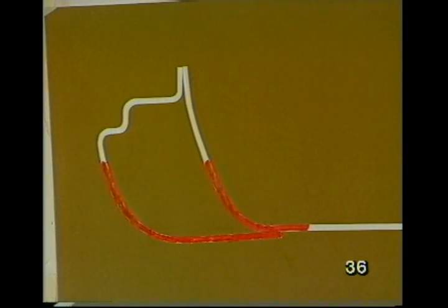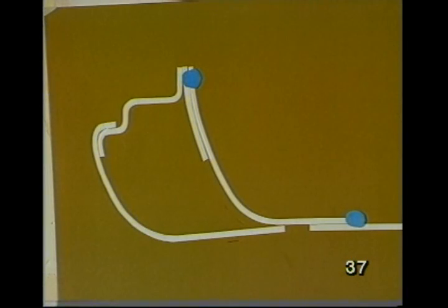These are the areas which have been rusted, so I'll cut away the inner sill and the outer sill, just leaving the tops, which will keep it all in line. First, I'll weld in a new inner sill, then the outer. I'll finish off underneath by welding the bottom of the outer sill to the new inner and tacking the loose edges of the old floor panel.